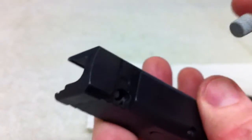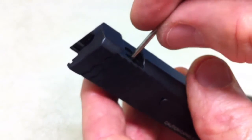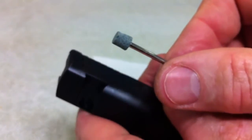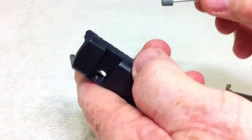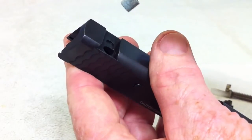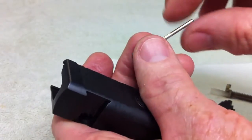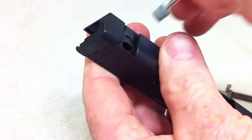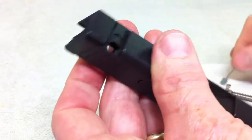What I did to get the burr that was in there is I used a little Dremel grinding wheel. I just stuck that little Dremel grinding wheel down in there and ran it up and down a couple of times all the way around. But the thing I will tell you is you cannot use this with the Dremel motor — the Dremel motor is very high speed. If you put something in there that is almost the exact same size, this thing is going to spin around and chatter, and it will bust. You need to have something low speed. What I did is I put this in the end of a drill motor, clamped it in at about 500 RPMs, and just ran it down in there in and out a few times. And I cleaned it out.